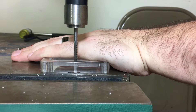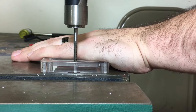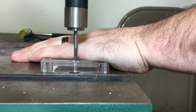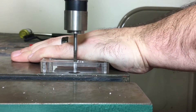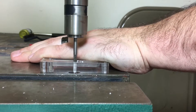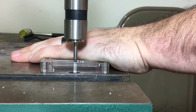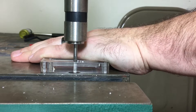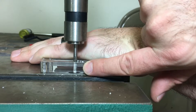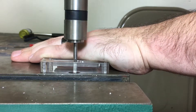Mind you, when I was using these before I found the gun tap, I was backing it out, but it was still causing so many problems. One of the things machinists will tell you when working with acrylic versus metal: acrylic likes to compress before it chips off. So when you're thread tapping a hole like this, it's going to cause problems. You can see it looks like it threaded just fine, but on the bottom that's a pure cylinder — there's no thread there.